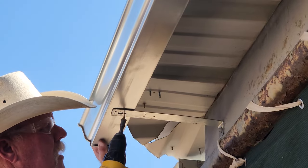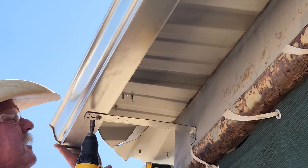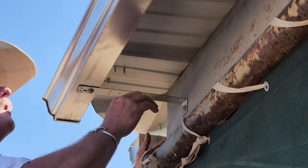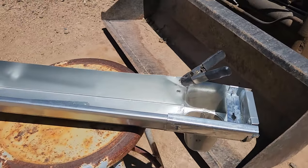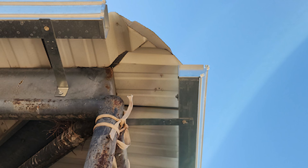On our 90 feet, the pitch flow was about one inch every 30 feet. You have to have that little flow so that it hits the downspout. The downspouts are just regular downspouts — you buy a little section for the end and attach the bottom.